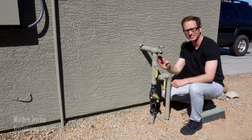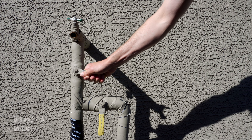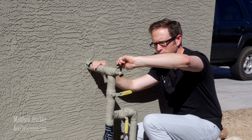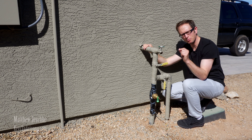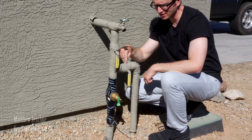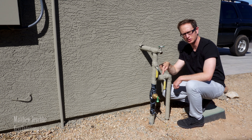This is our water line going into the house. The valve closest to the spigot and the wall is to turn off the water to the house — do that. You no longer have pressure to the house, and you can relieve the existing pressure by opening the spigot. When you return to turn the pressure back on, it's good practice to slowly move the valve so you don't have a sudden burst of pressure. Little trivia: this second valve here is if you have an irrigation system. That way you can turn off the house but leave the drip system on.